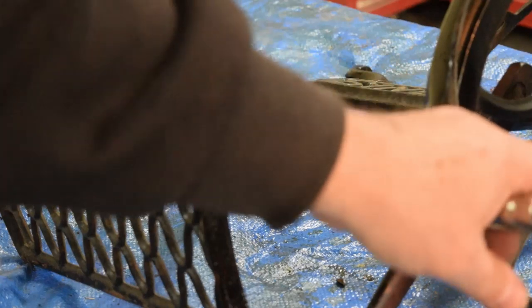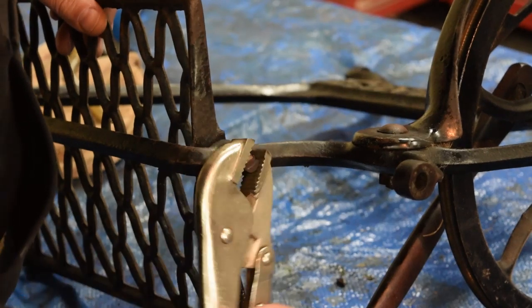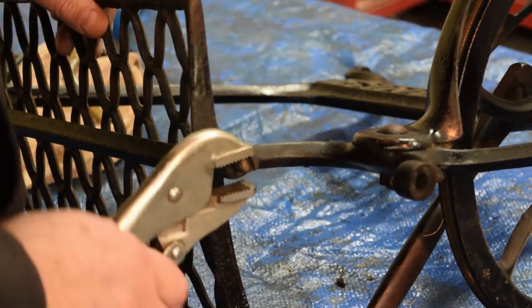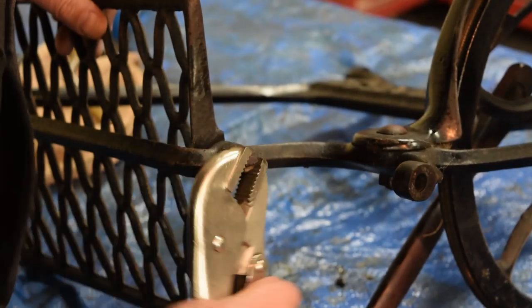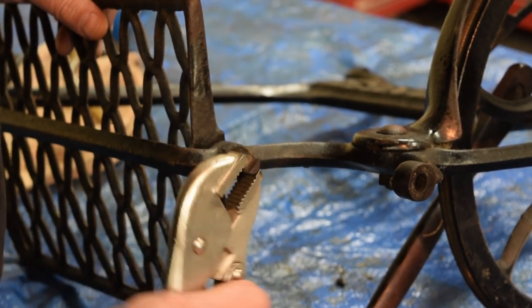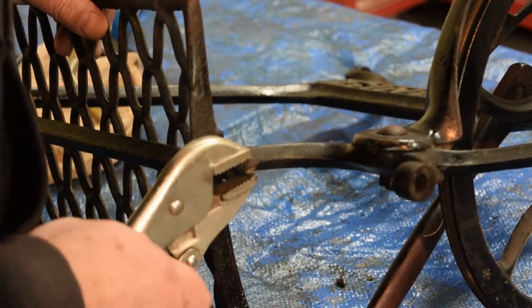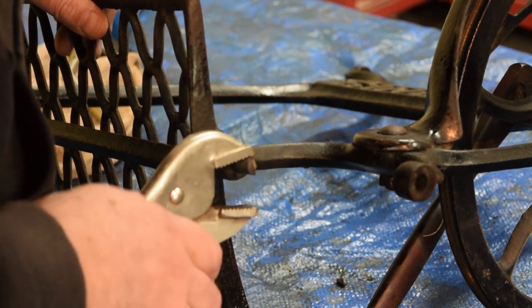Okay, fortunately we got it to turn. Unfortunately, the head broke off of it. I have a replacement for this, so it's no big deal, but it's one of those things that can happen when you're working on old stuff. And one of those I wish I had it back moments, I should have heated this first. I got cocky because I felt it start to go when I was using the screwdriver, so I felt that with a tap I would have it, but with a tap I wound up breaking it.